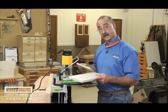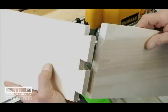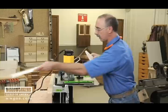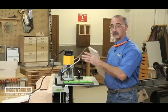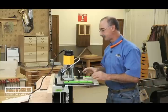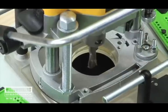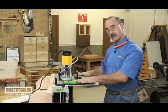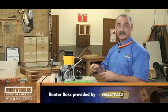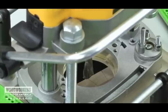There are a lot of different ways to make a dovetail on this machine. I'm treating it like the way I would do a hand-cut dovetail — I traced the tails I just cut onto the end grain of what's going to be my pin and socket board, and I can cut right to the line on the machine. Alternatively, you could use the cursor or the digital readout. I'll lock my board in place, get the bit behind my work, and eyeball my layout lines down through the machine. I changed my guides in order to allow me to cut at an angle — I'm cutting at the exact same 8-degree angle as the dovetail bit, so that gets everything to match up, and we'll sneak up on those pencil lines using the traverse mechanism.